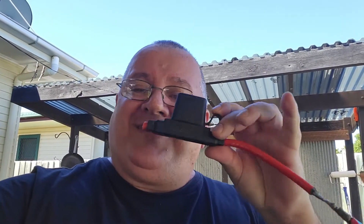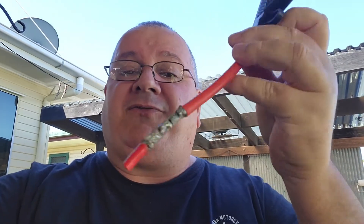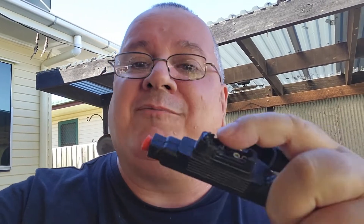A lot of people tend to use these type of fuses you see here. There's nothing wrong with blade type fuses — my Egon DC hub uses blade fuses — but I don't like these fuse holders. Here's the reason why: you see how that's just melted. The housing cannot tell you how many times I've seen these type of fuse holders where they've melted like this.